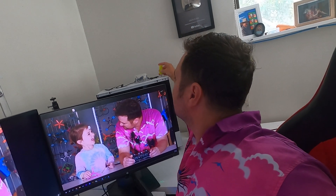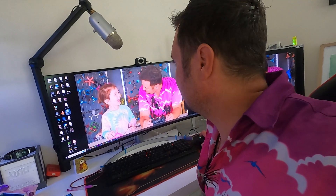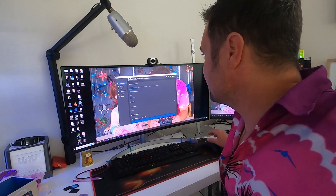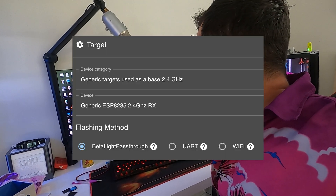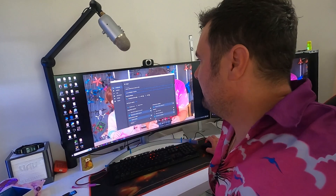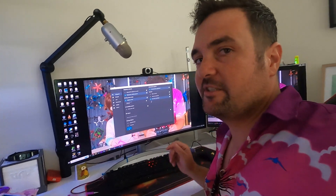Alright, excuse the mess. I'm going to plug the Squid Stick into the top of my computer — it is so easy to get set up. I'm going to open up my ExpressLRS configurator. What you're going to need to do is flash it to the same target as your radio. You go down here — it's going to be under generic USB targets. Make sure that your binding phrase is set to whatever your radio is, then go down and click flash. Bob's your uncle, you are ready and set up to go flying.